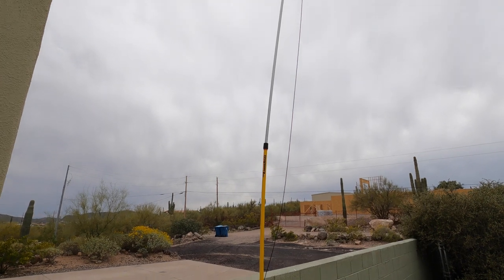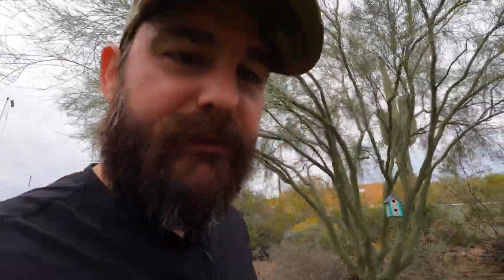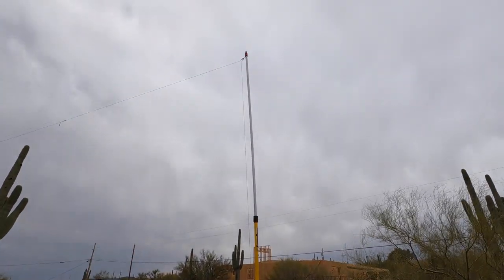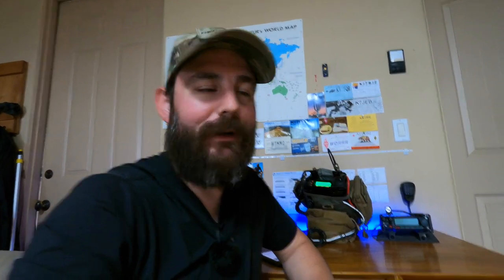It's the following Monday — I'm skipping my lunch trail run and have redeployed the antenna to test the NVIS deployment. I dropped one end down to 15 feet and am running it as a flat-top to the other end of my property using an identical painter's pole — a Mr. Long Arm. It goes right over the top of a palo verde. This is the deployment I really want to test for targeted local and regional communications. We'll be doing 40-meter NVIS tonight, connecting to a Winlink station about 60 miles west of us.